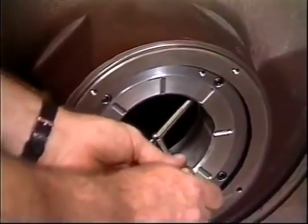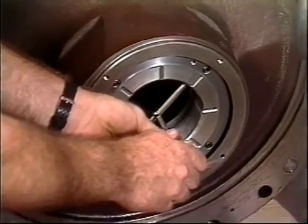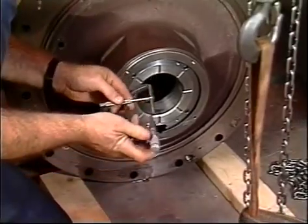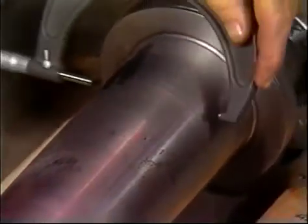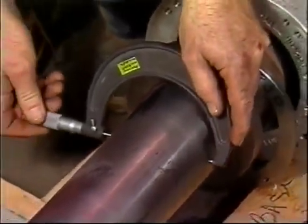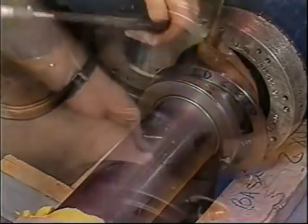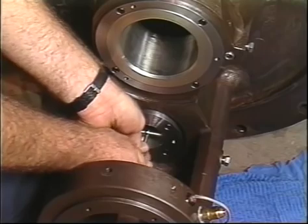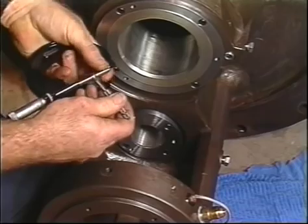Going beyond annual maintenance, compressor bearings should be inspected periodically, normally in conjunction with other major maintenance. This operation should also be performed only by experienced personnel. The frequency of inspection will vary with the type of duty of the machine, how critical the application is, the number of hours the machine operates, and under what conditions. If desired, a vibration analysis can be conducted by Carrier and used as a predictor of bearing condition.